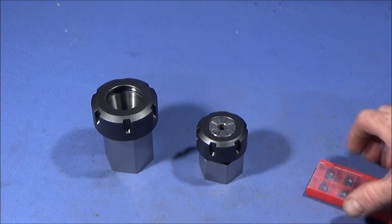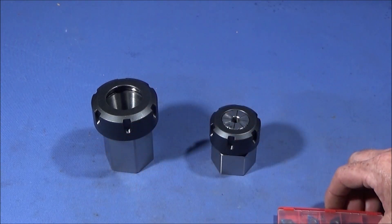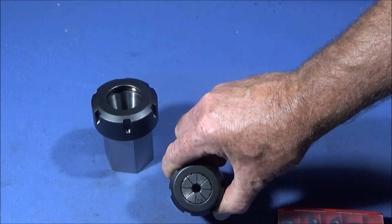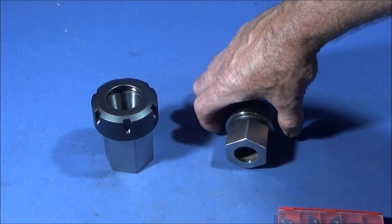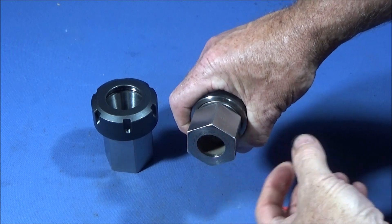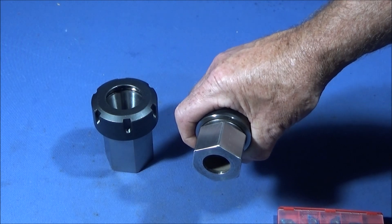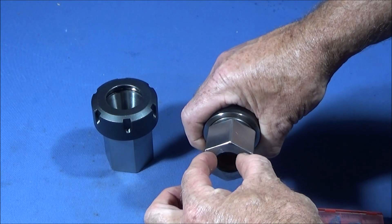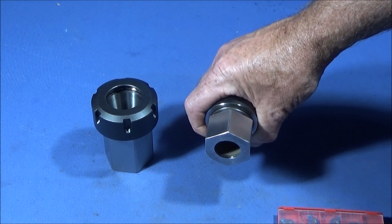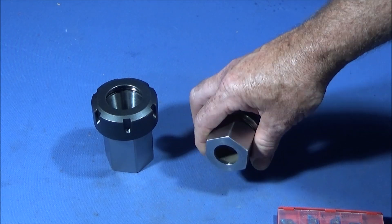The tool steel is so hard that I'm using blue nano inserts. I hold the nut which is screwed down onto the actual collet tightly, so hold the nut in the jaws like this and put a live center in the back, then turn down to a certain distance using the carriage stop and keep turning down until I've got a very thin ring with the live center still engaged, then take it out of the lathe and saw that ring off with a hacksaw.